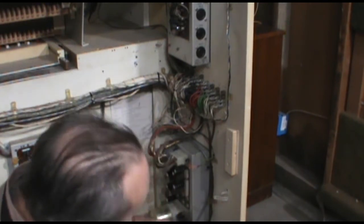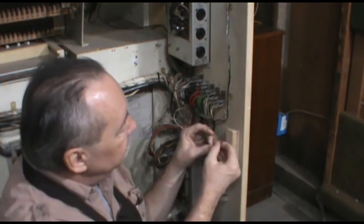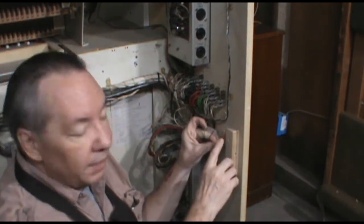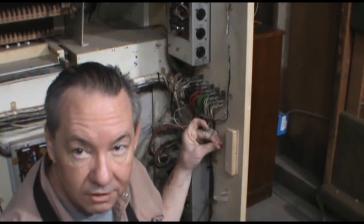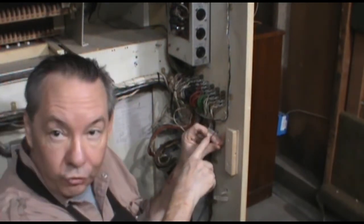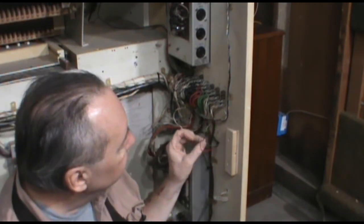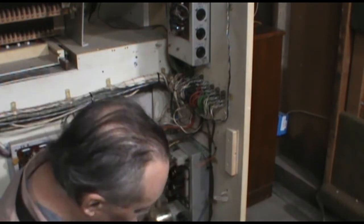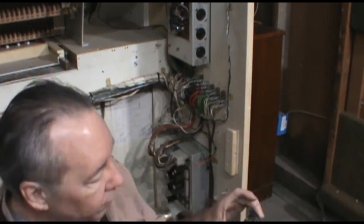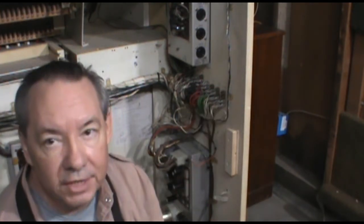So when we're looking at our voltage differential, the differential between 12 volts plus and 12 volts minus is, of course, 24 volts. But we have our neutral position in between. So when you measure from ground to either of these, you only get 12 volts. In fact, we're actually running this on 24 volts, but it's 24 volts with the center tap.